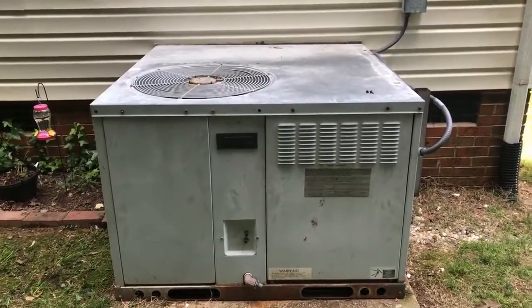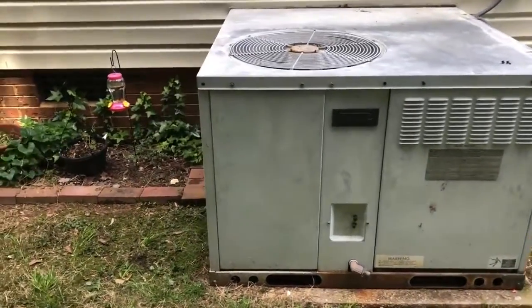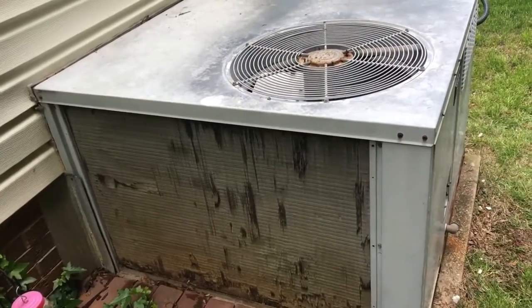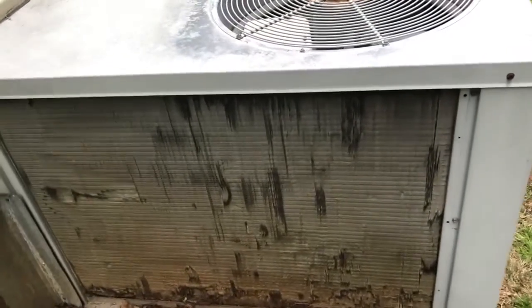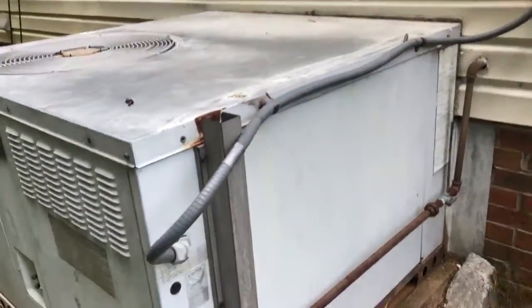So let's take a look at what my furnace actually is. One of the annoying things about recording is that I can't flip right over without just turning around. Here's my unit — you can see how old it is. Just a quick glance, you see how dusty the side of this thing is. It's been through heck and back. I'm not even sure how air gets through those things, but the air is working now. It was the capacitor, not the compressor like the HVAC guys told me.